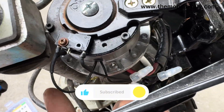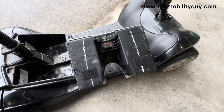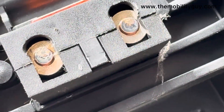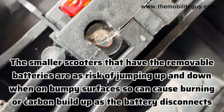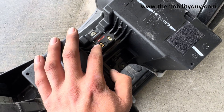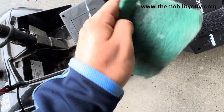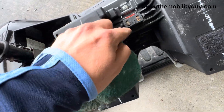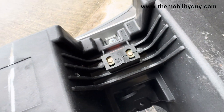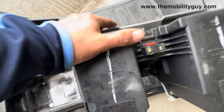That's been soldered — always try to get some shrink wrap on it. Sometimes it's easy to take the brake off but it can mean having to realign the brake and everything else, so that's nearly a bigger video. Now I've also noticed these connectors here — they look scorched. We're going to clean them out as well. Do not use a wire brush on both at the same time because one is plus, one is minus. I'll give them a clean with an abrasive pad — it's more like a sandpaper type thing. It's not a permanent solution but it keeps the connection good for another year or two.